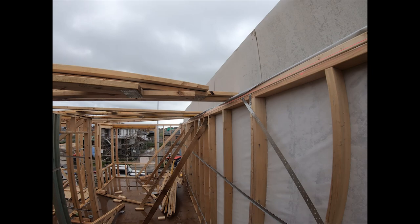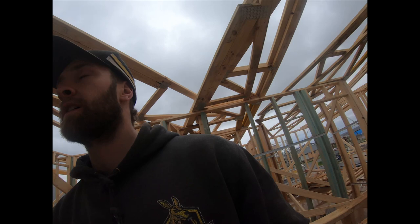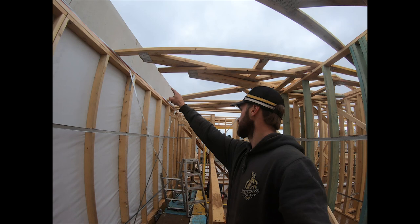When you're doing trusses, obviously starting with the straightest walls possible is the best way to do it. But it's not uncommon for us to straighten one side, and we'll pin the tail of the truss off to this end, and then we'll pull that other wall straight with these trusses. Because the trusses are a set length, it's easy to push and pull the wall in and out to suit based on the trusses.